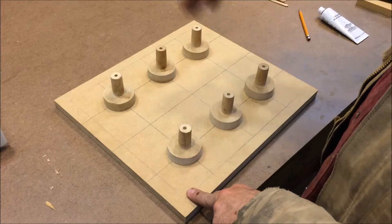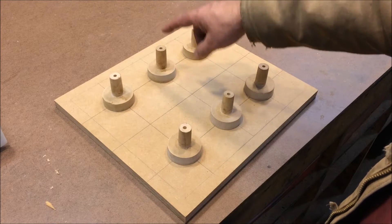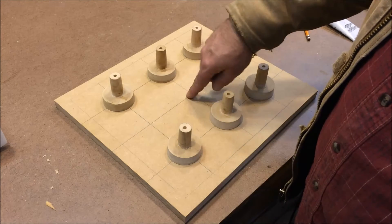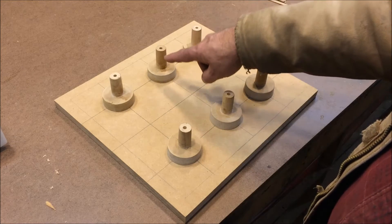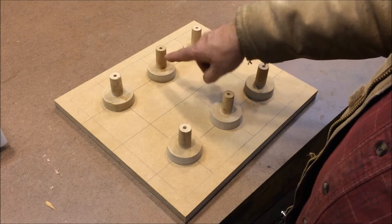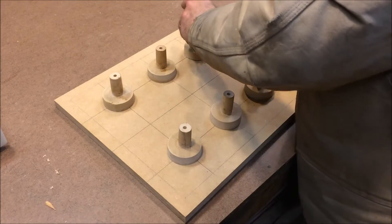I laid out a grid: came in three and a half inches from the edge, put one in the middle, divided it down the center, and then divided that in half again. I drilled some holes in the top — I'm going to put a quarter-inch dowel out the top of each one to act as a vent. Then I'll put my sprue in the middle and it will run down and feed each one. Hopefully the aluminum will fill these and come up a little bit — each one might need a riser to prevent shrinkage, but we'll see.